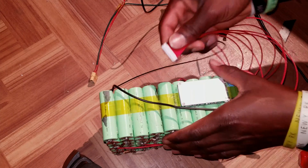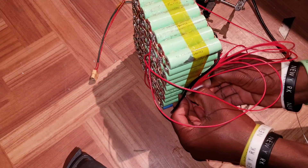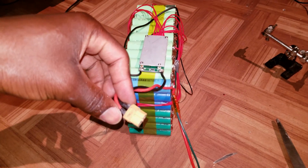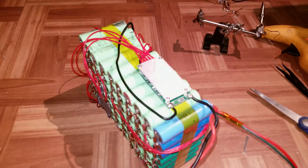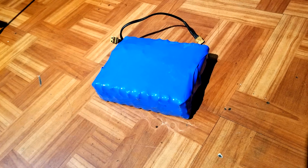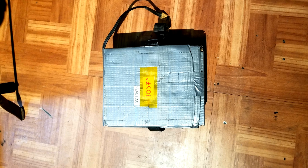Now the balance wires will go right here. Here is the pack. I'm gonna get some shrink tube and shrink it down to kind of hide the mess. This one hooked up to the BMS will be used for charging the battery, and this one straight from the cells will be used for discharging — so no issues with the BMS trying to limit the power. That was it for how to build a DIY battery pack. If you found it useful, make sure to leave a like, comment, and feel free to subscribe for more videos. Thanks for watching — see you in the next video.